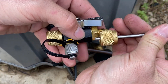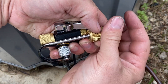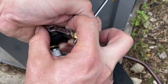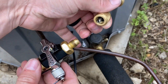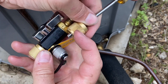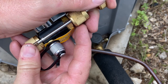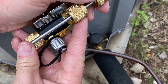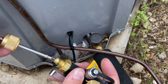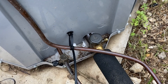So essentially, this piece threads on. Valve is open, we go through, we loosen our valve core, we pull it out, we shut the valve off, put a new valve core in, screw it on, open this valve, the tool slides past our valve here, and then we can thread the new valve core inside the system. Very handy. We're also going to be using these when we do recovery and vacuum for a faster recovery and vacuum system.